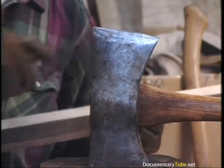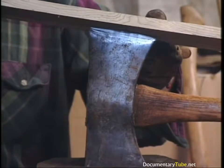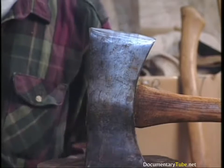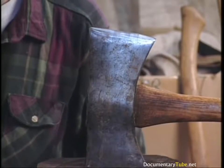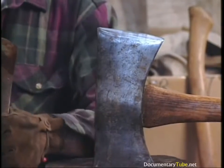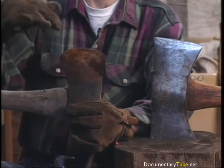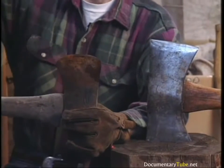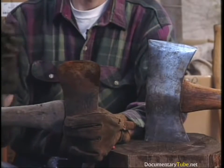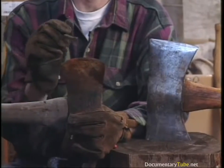When we look at this head here and think about it coming into contact with a board, there's a lot more efficiency. So that's basically what we do with head shape. When a lot of tools come as blanks and they're not used, and we start filing them in order to bring them back to a flattened shape, we'll do most of our filing from this point here to this point here, and we'll let the edges take care of themselves.